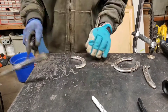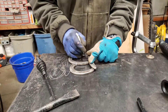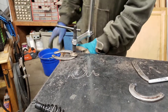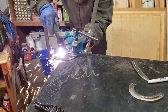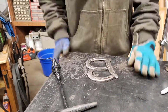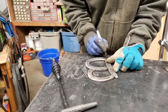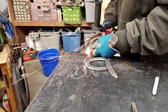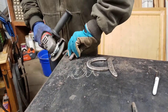Knock off the slag from the edges. Measure the bottom piece and cut those. Now it should all fit together. I'm marking it so that I can give a little grind on the areas that are going to be welded together, so that I'm not just welding on the top surface, but the welds can kind of penetrate a little bit.